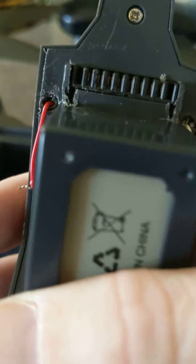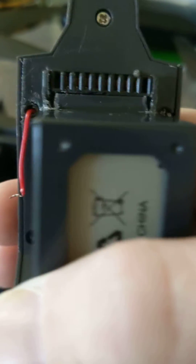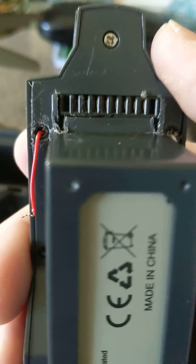So what I decided to do was go directly to the positive and to the negative, and I can hook it up to my hobby grade charger and charge this battery in less than an hour — about 50 minutes. That does not balance it; it gives it an overall charge of 8.8 volts. You charge it under LIHV settings at 3.4 amps and it takes about 50 minutes.